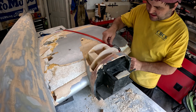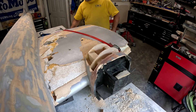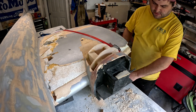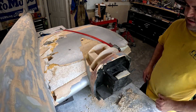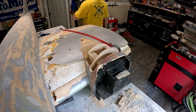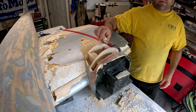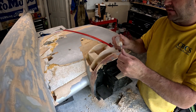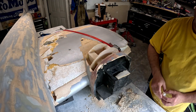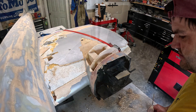I did not pull this one as tight as I did on the wing panels because I did not want to mess up this corner of the trailing edge — there's a nicely carved piece of solid balsa there that I do not want to have to re-carve. All I have to do now is take my little brass tube tool, fill it up with some more Gorilla Glue, and go down through this seam and inject Gorilla Glue in it as tightly as I can.